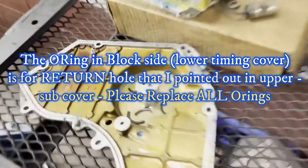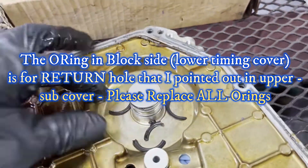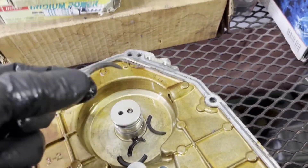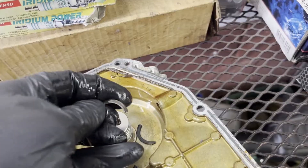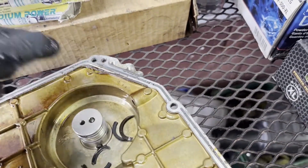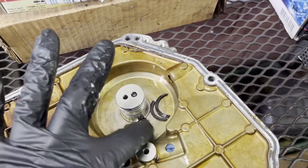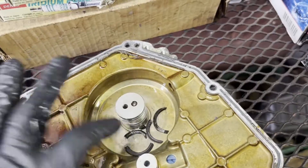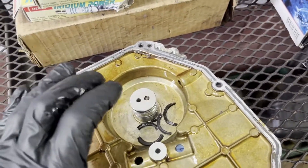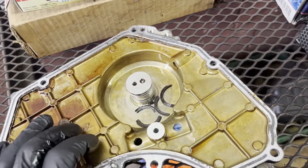Look at what happened to these O-rings. There are three O-rings on this pintle, and all three just fell apart. When I walked the cover out gently, they're like glass — hard as a rock, and they crack. They don't bend; I can just take this and snap it. These rings have to be replaced no matter what. This could actually have been causing a lot of the problem as far as timing fluctuating quite a bit, because even if the valve's working and has good oil pressure, you're blowing oil past these seals.